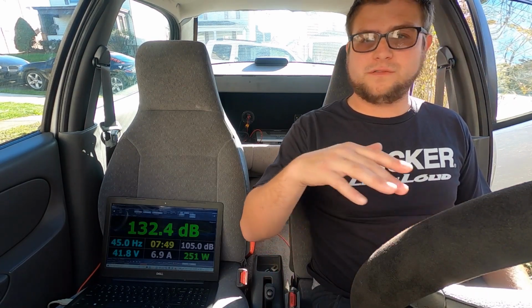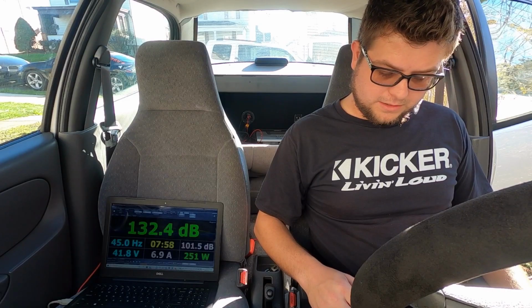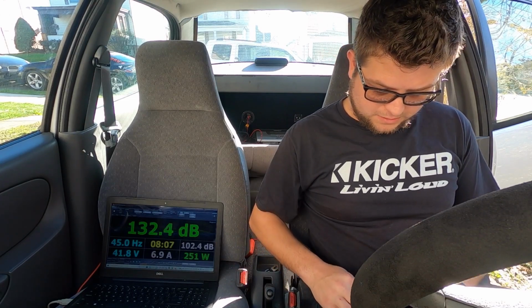Now that's what's nice about this box. It is pretty flat. It's not really designed for SPL per se, but it gives you that nice flat curve. So from 50 to 47 to 45, we're really not seeing a big SPL gain or loss, which is nice. All right, so we already know we were the loudest at 45 hertz, as it shows right there.